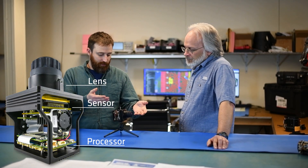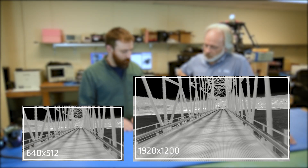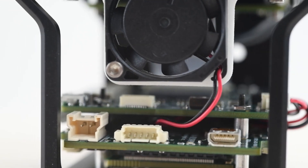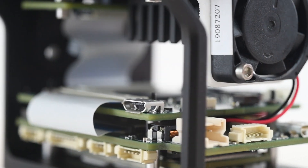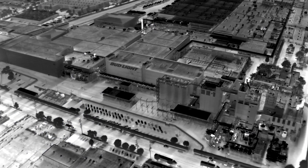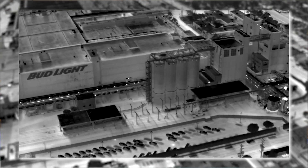The general architecture of the camera consists of a lens, a sensor, and a video processor. It has a 1920 by 1200 sensor connected to a video processing architecture with an encoder that provides IP video and HDMI. Sierra Olympic has two lenses custom designed for this sensor: a 25mm lens giving a wider 50-degree field of view, and a 50mm lens with a narrower 25-degree field of view.